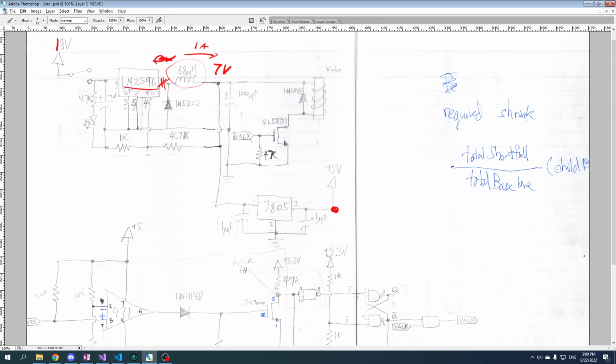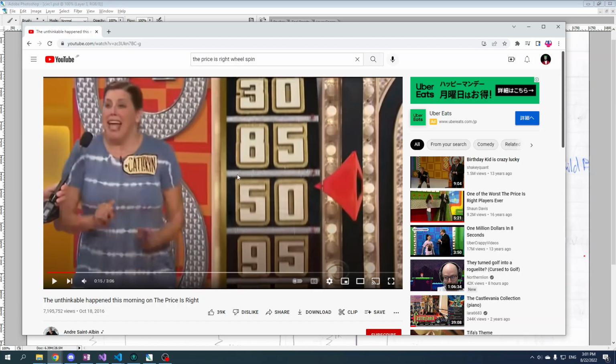It is going to make sure that there is no discontinuity in the current flow, which means if you, for example, had a switch and you open the switch contacts, it would still try to pull 1 amp across that air gap, which means that now instead of maybe having 19 volts develop across that gap, you're going to get maybe several thousand volts.